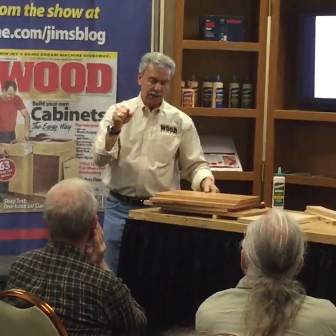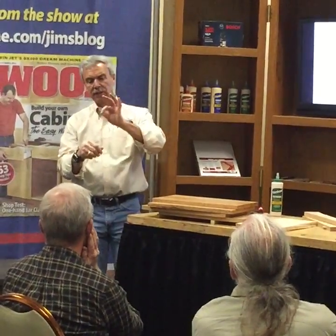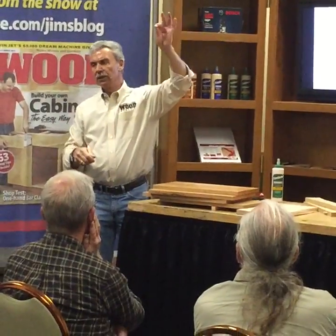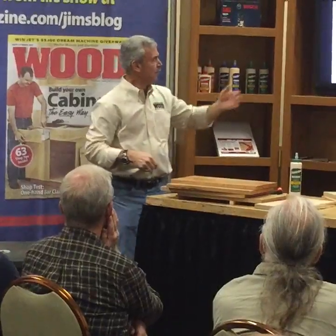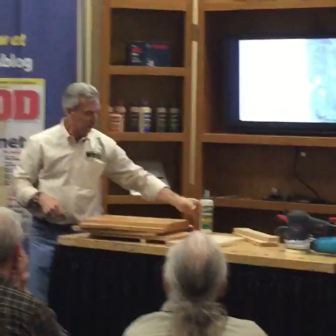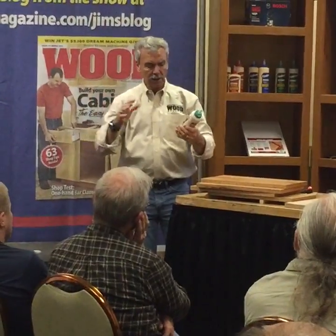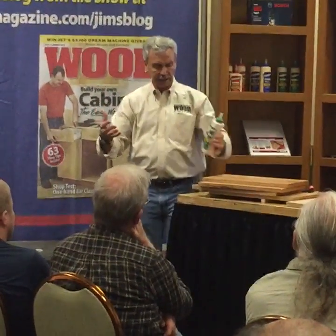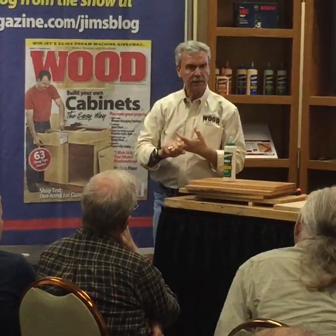If some of that edge gets glue on it and it's dry, and you run that chisel or that putty knife down there and pull a sliver out of that, you will never sand that out. It's just so deep. So the point is, you have to wait for that, and that's the problem. The glue in general, finishes, glue, everything. All of the drying times, curing times, and everything are based on 70-degree temperature and between 50 and 70% humidity.